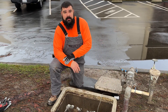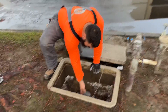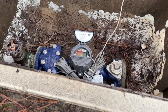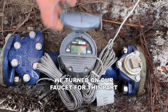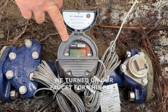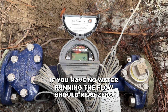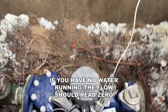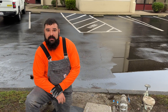If we wanted to determine whether or not this meter had a leak, we'd be able to open up this lid here and take a look at this dial and watch our digital readout. As you flip it between the settings, this is your flow indicator. You currently have flow running on your meter, which means there's water actively running. On other systems you're going to want to isolate your irrigation away from your domestic to determine which one is actually leaking.